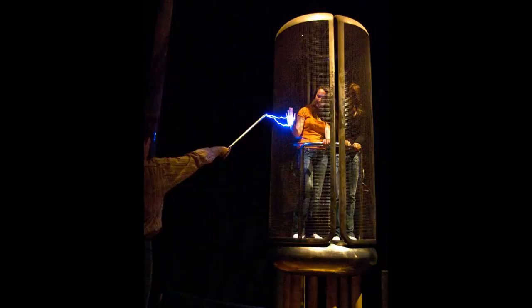So if you are an engineer building products, especially products that have motors or magnetics or RF components, you know that eventually you get stuck with too much interference, either interference for your device or interference between your devices. And so you need something like a Faraday cage, which is, like, in this cool graphic from Wikipedia. A Faraday cage is a metal enclosure that keeps the electrons on the inside and the electrons on the outside, basically. So it shields the outside and the inside from each other. It goes both ways. So you don't have interference into your circuitry, and you don't have interference to other circuitry being emitted.